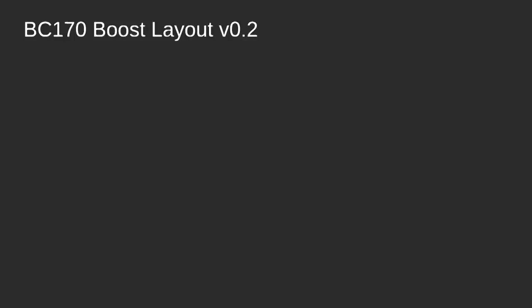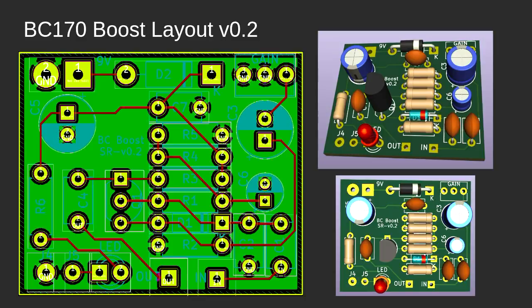So the second layout — I actually used both sides of the two-layer board. In addition to connecting resistor R3 to R4, now I didn't have to bridge that with my first run. I still used the first run — that's the one I actually brought with me. Once I made that fix, I didn't do any real proper testing, I just wired it up to the guitar, hit the strings, applied power, and bam, it was on. It was so cool to have built something like that. Even though the process was reproducing and going through the motions, there is a lot of value in that — learning that design iteration process, which is big words for screwing up and then redoing it and fixing it.